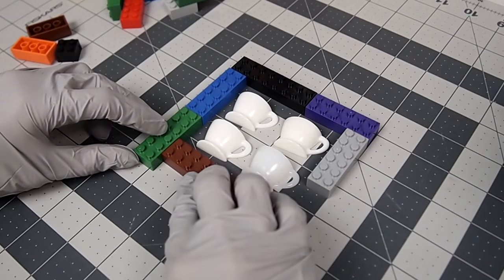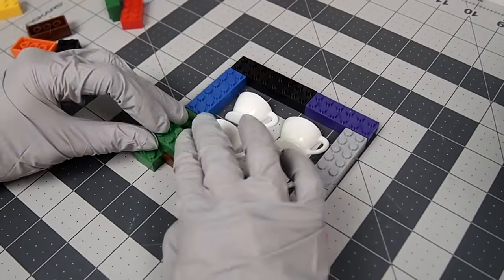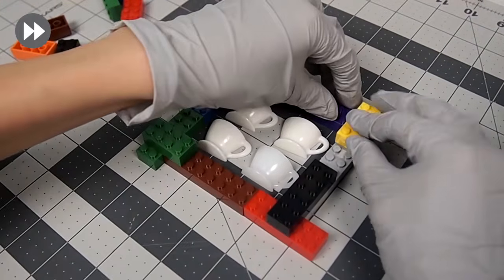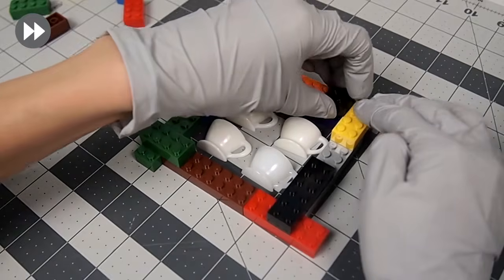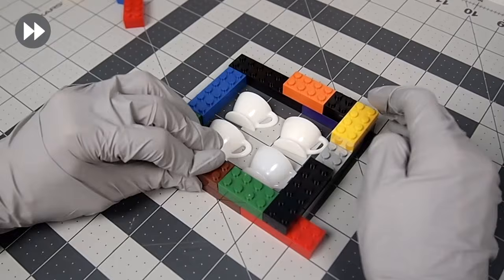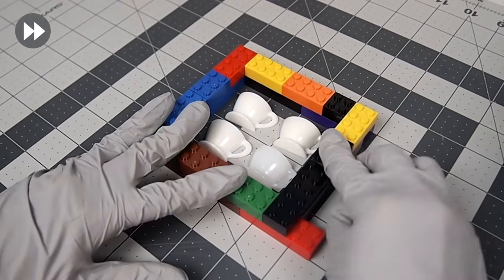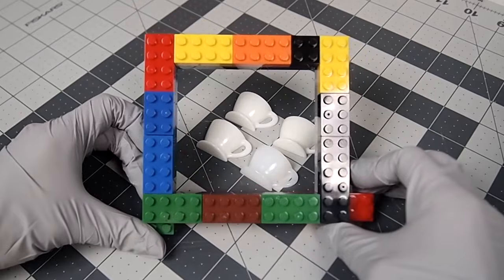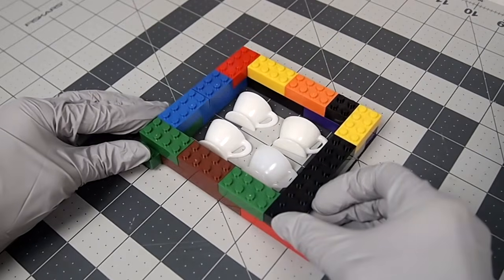I find these building blocks work perfectly since I can make it at any size I want without the risk of wasting silicone. Also, it's reusable and it's space saving since you don't have to have different sized mold boxes in your stock. Make sure when building your mold box you have at least a 1/4 inch space between the mold wall and the original so we don't have the risk of the mold tearing.